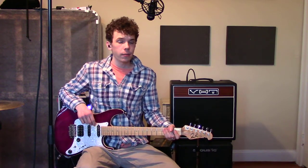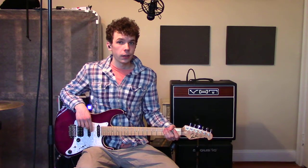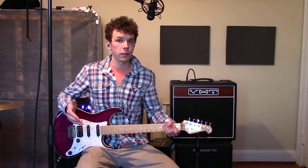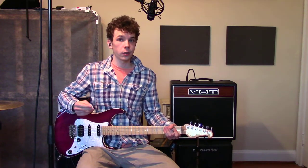So already halfway up on channel 1, it's pretty dang distorted and it's pretty dang loud. The reason for that, I believe, is because if you think of an amplifier's job as taking a signal and amplifying it as pristinely and purely as you can, I think the 5E3 is the worst at that. It is really bad at its job, so it distorts really, really early. In fact, I think it's fair to say that it starts to break up at around 3.